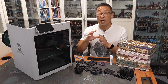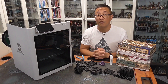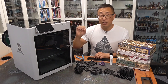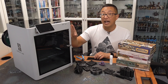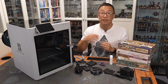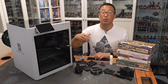All these other prints I made required only about a quarter to a third of the time compared to my typical prints on my MK3S's. I run my printers at stock speed rather than pushing the envelope, because I'd rather they last long. That is one of my concerns with this machine — given how fast the printhead is moving, I'm a little worried it might not last as long as my Prusas. My original Prusa has run for almost four years and is still going strong. The only replacements were some nozzles and the bed heating cord. So I do wonder whether running so quickly will cause a breakdown more quickly.